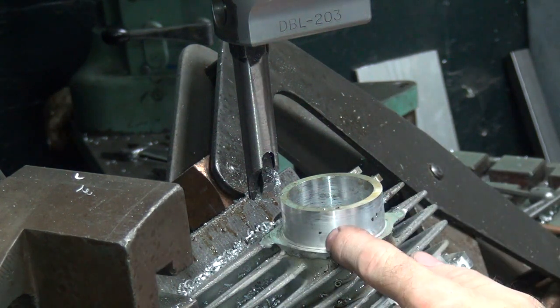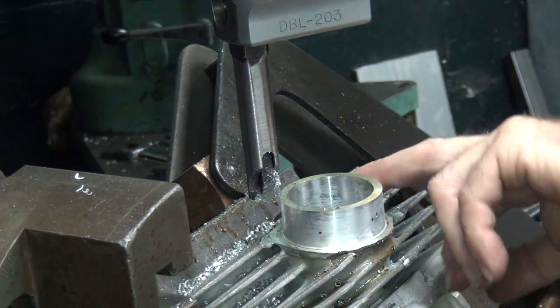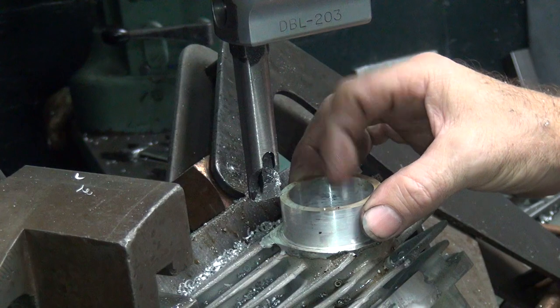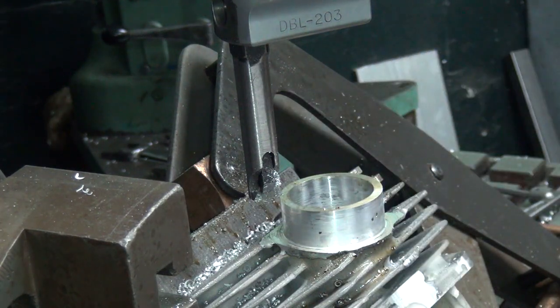So there's a little porosity hole there, a couple right here, one little spot over there. Looks good on the other side. We've got our depth cut, our OD and ID cut. I'm going to put a chamfer on both sides here for putting a pipe on it, and then we'll be done with this for now.